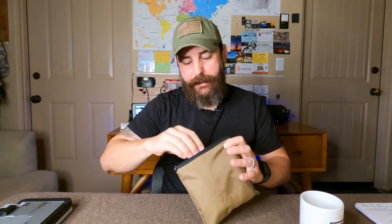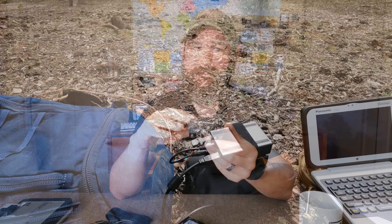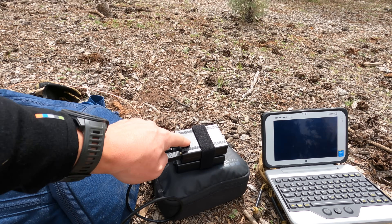In terms of the rest of the gear for the entire station, it's just in these two little bags. Let's take a look at the first bag — let's pull everything out. I have the QDX by QRP Labs. This is a 5-watt, 5-band transceiver, and it's the low-band model. This will cover 20, 30, 40, 60, and 80 meters.